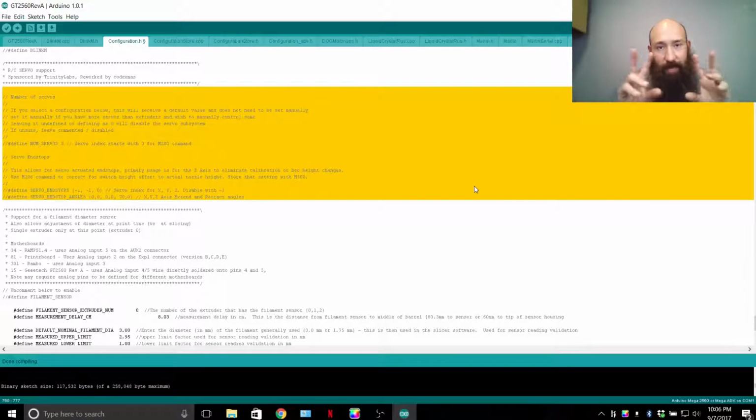So it's bringing in the 12 volts and regulating that down to 5 volts and 3.3 volts for other functions on the board. By adding a second chip, you're essentially having two power supplies running in parallel, removing some of the strain. So in my RAMPS 1.4 board that I'm currently making and testing, I have the Bluetooth, I think the DRV8825 stepper drivers, and PWM fan control. I'm not sure if I'm still going to do servo control, but I'd be able to run all that even with the full graphics LCD and still power it all and not burn it off because I've stacked a second voltage regulator to it. Sometimes stacking 3 may be a necessity. It depends how overkill you want to go.